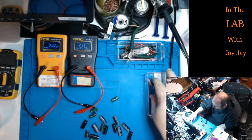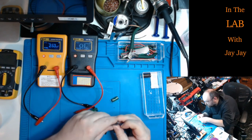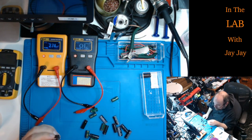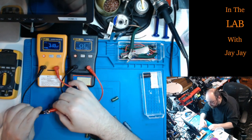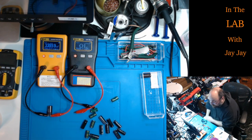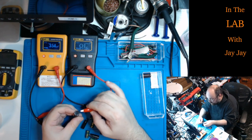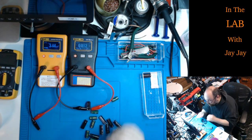Now, we had some luck with this big honking thing. So, this is its brother. This is a 10 volt 3300 microfarad Nichicon. I'm expecting this will work just fine, so it should give us a good sensible capacitance reading. And up we go. 3,390. Very happy about that. And any ESR less than about 0.1 will be considered pretty good. So let's give that a try.